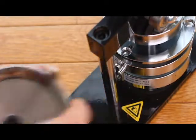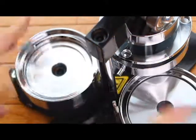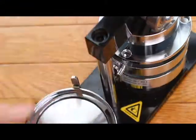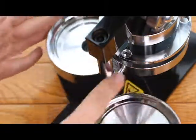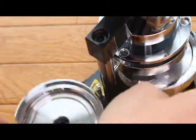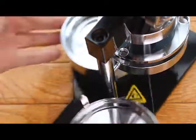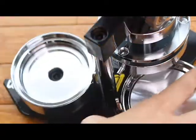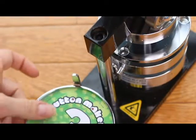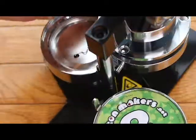Now I'll show you improperly aligned. These positioning posts are improperly aligned. When you rotate this around, this positioning rod doesn't hit this post at all. This upper die doesn't move at all, and you will fail to make buttons properly. Buttons will fail — it doesn't pick it up at all.